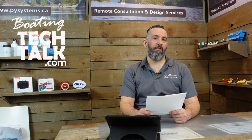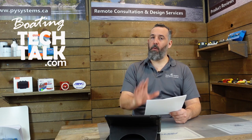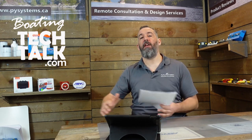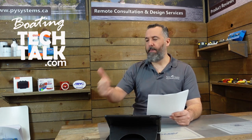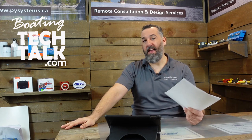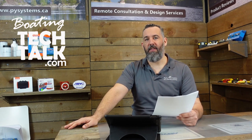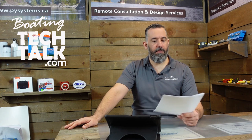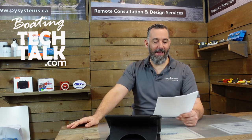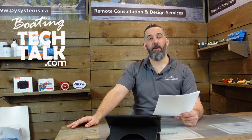So that's probably four-aught — it's probably a 3,000 watt or a 2,000 watt inverter that is further than you'd like from the batteries. Four-aught wire is about the size of a thumb in terms of thickness, and in the marine world it's pretty much the largest size cable that we install. I reviewed your past posts — you're doing your research, educate then do — and by looking at some of the photos, it appears that you use yellow for inverter chassis ground connections.